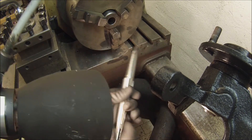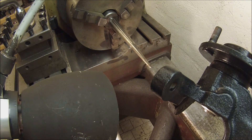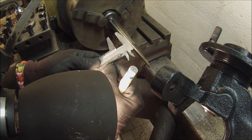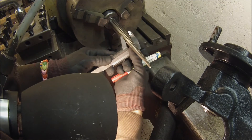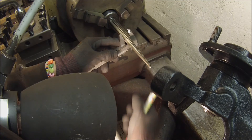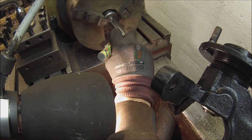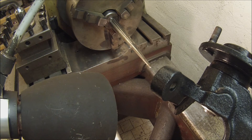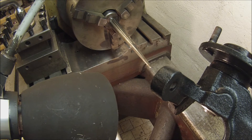What I actually could do here is to measure where I have the — let's see — that's 15 millimeters, and we're supposed to go to 17.5. I could measure where on my reamer I have this measurement and just put a little mark on there. That will give me some idea of how far into the hole the reamer is supposed to go. As I said before, I really don't want to risk going too far and making the hole too big, so we need to take it pretty easy here.